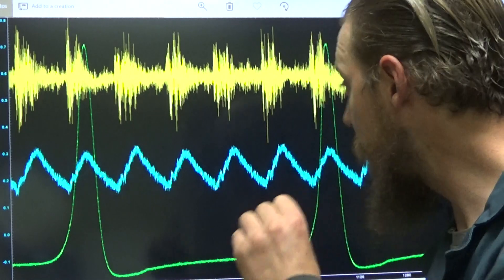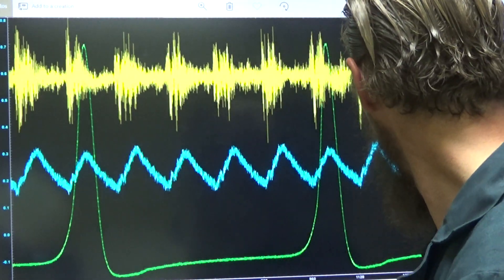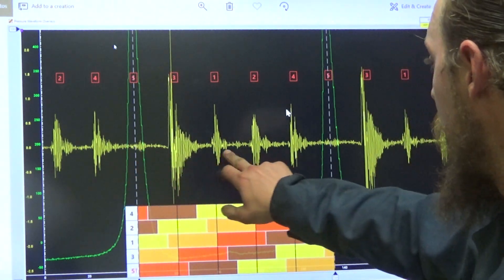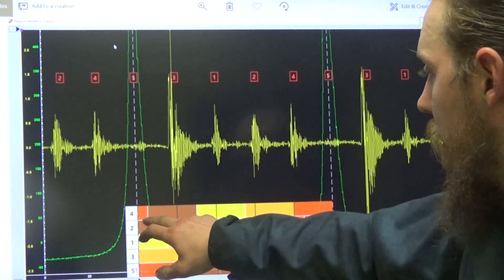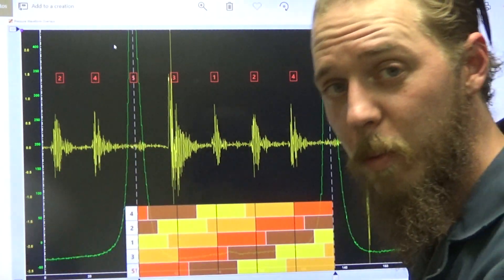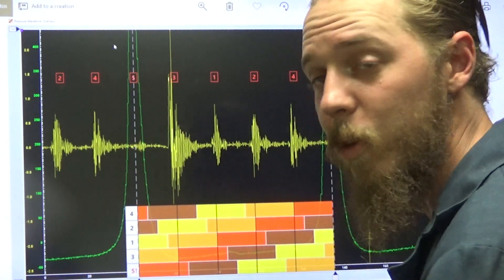To prove the pulsations occur, we've got a relative compression test. Number five — following it through, there's a pulsation for each hump. Zooming in further to prove the point: there's validity here. If there's turbulence within a line, we can pick that up. Five, three, one, two, four — we can even determine injection timing to a certain degree.